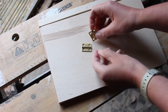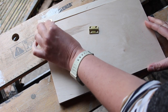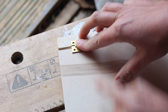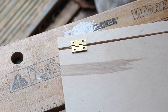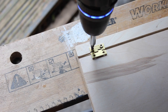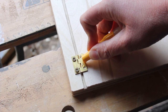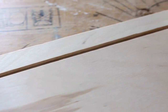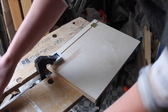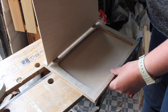We're going to attach the lid now and I'm using these little butt hinges. Ideally I would have used a different hinge, but these are the only two I had left, and as we can't go shopping this is what I have to use. I'm going to line them up — they're around 3 centimeters from the side. I'm using them the wrong way around because then it opens nicer. We're going to screw one side in place, but as my lid is way too thin, I'm going to have to superglue the hinge to that. Just put superglue on the hinge and press it down — don't do this with your fingers because you might stick your finger to it. I clamped it down for 30 seconds, and as you can see the lid opens. Really coming together now.